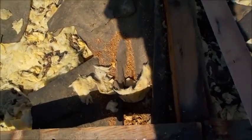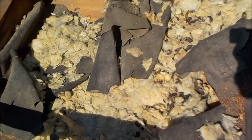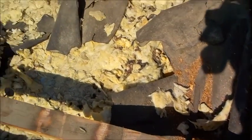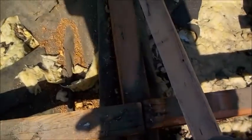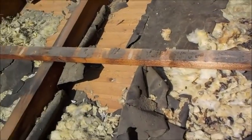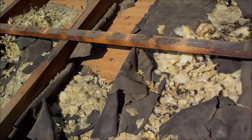We're putting boards on, look, here, because the span here is like 4.5 feet. And if I just put that on there, they'll sag in the middle. So I've got to put boards underneath, and I'm putting these sprags in here, these 4x2s, to help support these boards. And now at the moment we're just taking these 4x2s off and screwing that, so 1, 2, 3 off, and bingo, we can get this board lathered in.